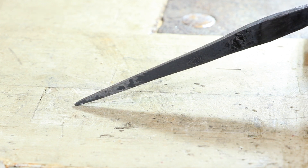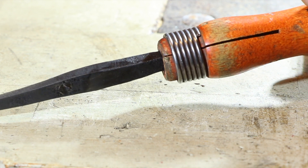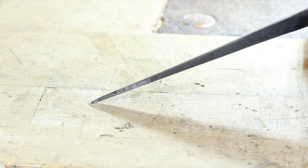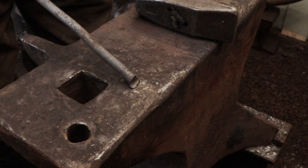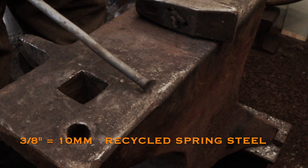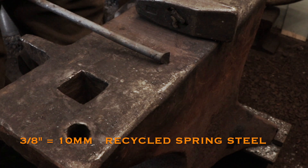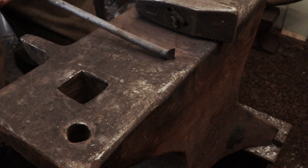As you can see, there isn't anything special about this reamer — it's just basically a flat bar with square edges and the end of it gets jammed into a standard file handle. You can make these reamers out of just about anything; it doesn't need to be anything special. A recycled file is fantastic because it's designed to cut metal, but I'm just using steel — it's a three-eighths round recycled spring steel — and they work fine.